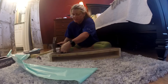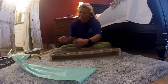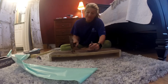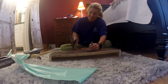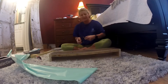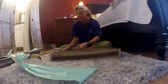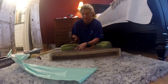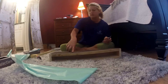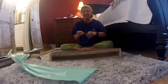You can do it two different ways. I had one bulge on me a little bit, which is why I started using the glue. Either you can start in the middle and work out, or start to one side and go over — it does a little better. Don't try to do one outside edge, then the other, because you're going to get a pucker. I learned that the hard way.